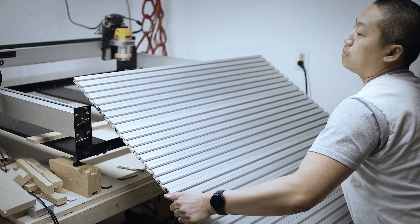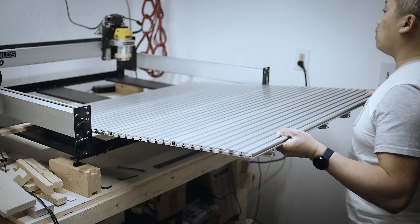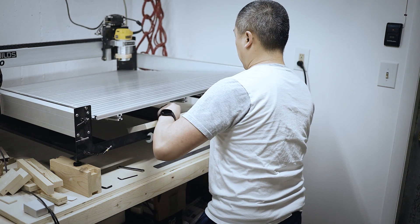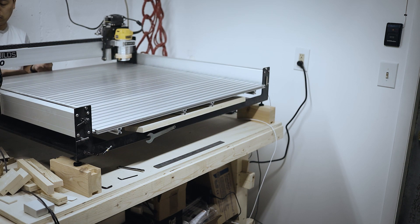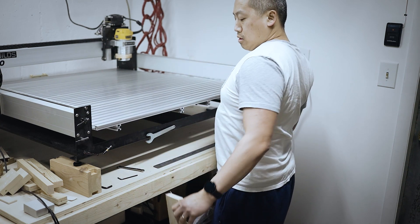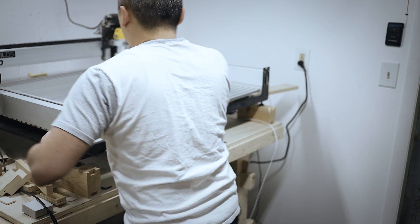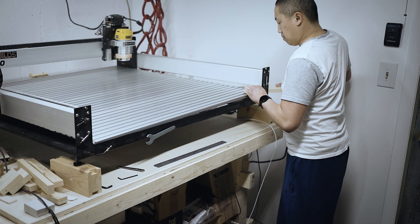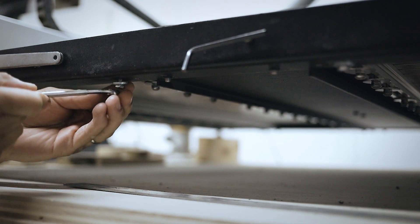I needed to carefully lay down the table, so I used a piece of scrap to help guide me through the frame. To screw the linear rails to the frame, I used M5 screws with a 25mm length and I doubled up the washers to make sure I have clearance between the linear rail and the flat aluminum extrusion.